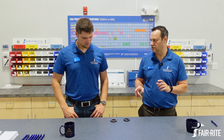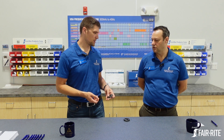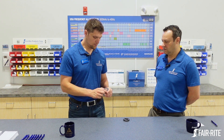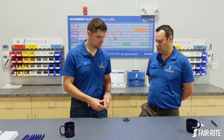What type of applications would either one be used in? For a toroidal core, you may be looking at something like a transformer or inductor along those lines. For suppression cores, most ferrites are used in common mode for the most part, because they have bias currents that can saturate them. They are used for differential mode applications, but more often for common mode applications, keeping concerns about bias and saturation low. These could be used as a common mode core over a wire or wound for common mode chokes. People do use toroidal cores specified to AL and loss factor for common mode chokes, but you have the option of either, and we have the proper spec for impedance-rated chokes.